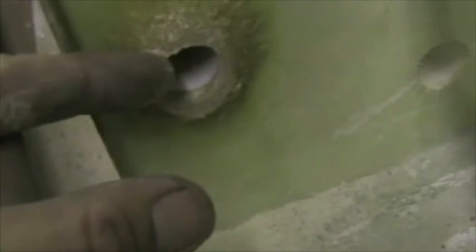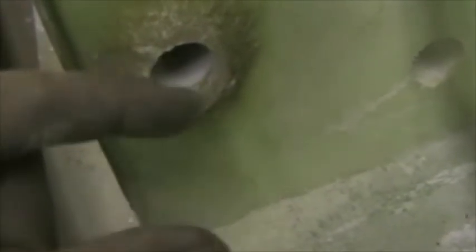On the wing root rib I've put in the final Teflon tube, and you can see I've taken the cotton flock around the tube to ensure that it can't come loose, because if this Teflon tube were ever to come loose, it could cause a jam between the rod end hinge mechanism here and the root rib, so make sure that can't ever dislodge.